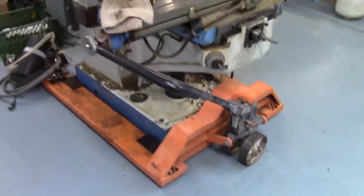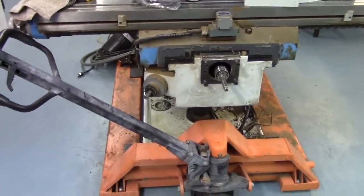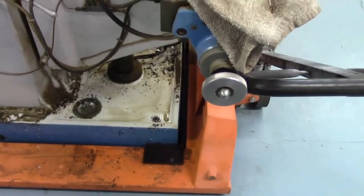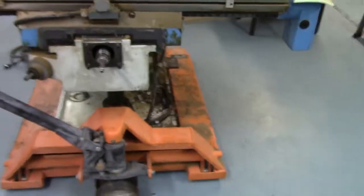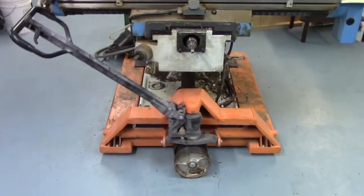You might be interested to see my modified Harbor Freight pallet jack - we actually widened it up so it would straddle a mill. It saved me a few dollars by moving some of this equipment myself. It's very heavy angle iron that goes across between the legs of the pallet jack, and the mill rests on those plates so I can just roll it around. It's very close to the ground, so it's pretty safe and works well. I've moved my big mill several times with it.